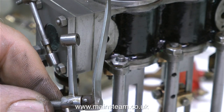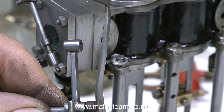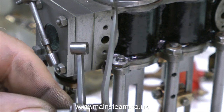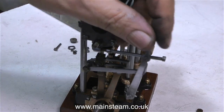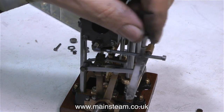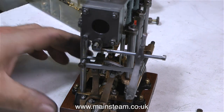This clip shows the reversing lever with the reversing arm and the drop arm, ready to fit to the engine. This reversing gear looks to me to be a little bit unusual. Normally a reversing lever goes up and down, but this one goes from side to side. It does the same job, but it's not what I'm used to seeing on a Stuart engine.